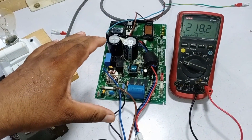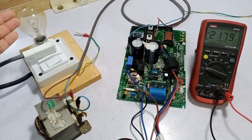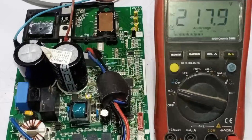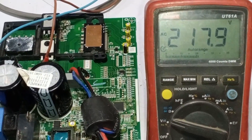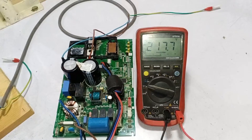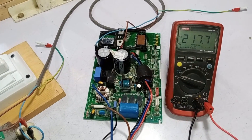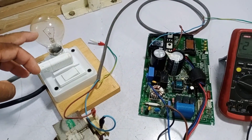No other problems occurred. If the short circuit had been much greater, the bulb would have kept glowing or could have fused — that is the benefit of the series board. You also saw that 218 volts are passing through the circuit board, and these voltages increased gradually. The benefit of the voltage increasing slowly is that if there is a problem in the circuit, the bulb will fuse at low voltages or will not glow, which prevents the rest of the circuit board from getting damaged.